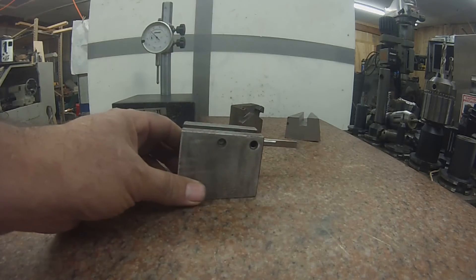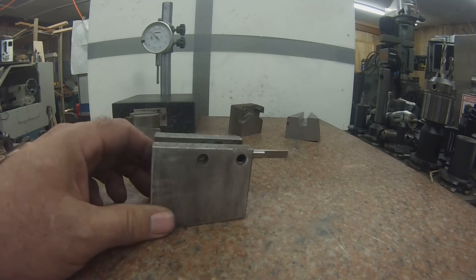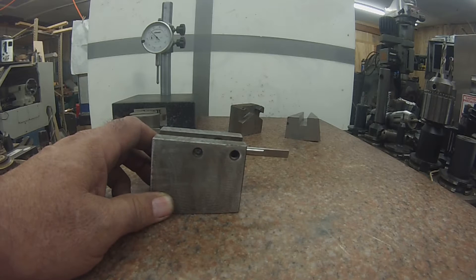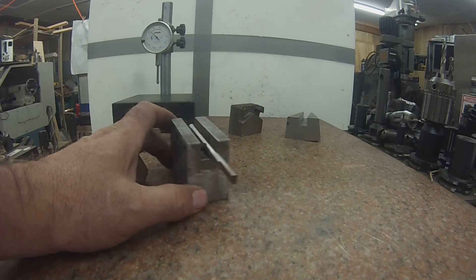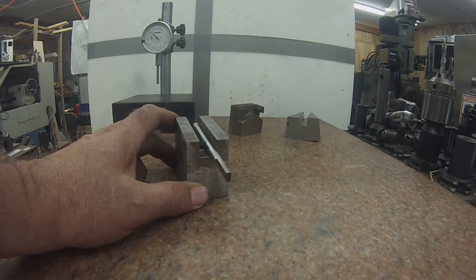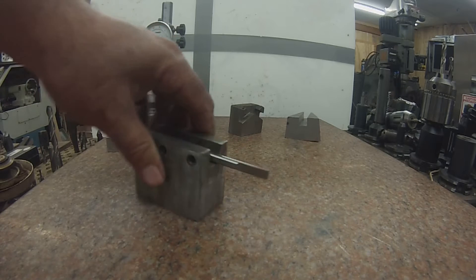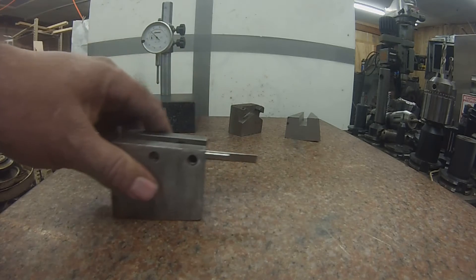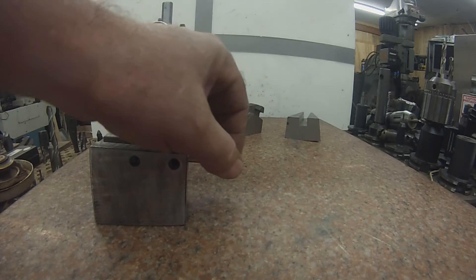And you flip it up like this and grind the top off — it gives you front clearance. That's something that's stuck with me for a long time. Where I work now, they get parts rapid-prototyped and sometimes they don't finish the job — they go as deep as our cutters can go. This one part has two internal keyways roughed out with end mills, finished as far as they could go but not all the way through, so I have to make a broaching tool. This block will also make broaching tools and cutoff tools, because all the clearance angles are about the same.